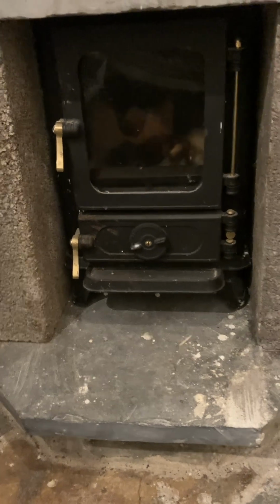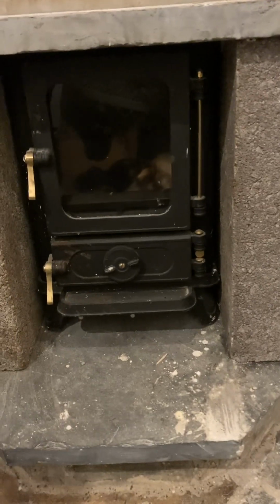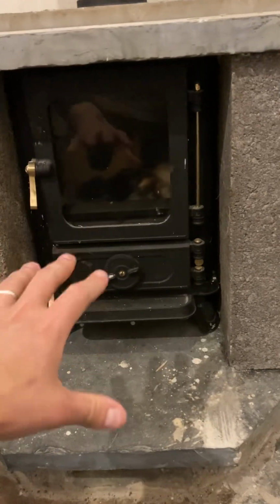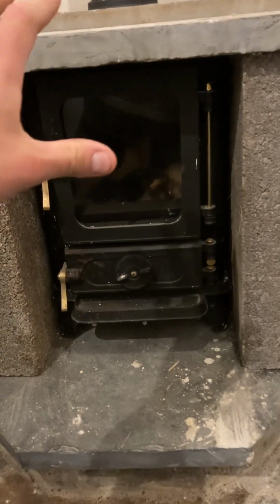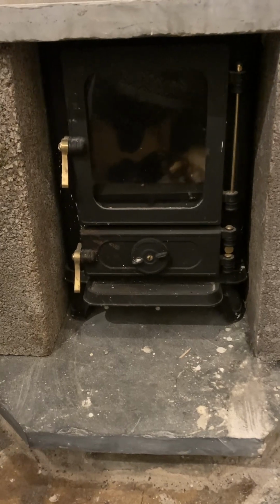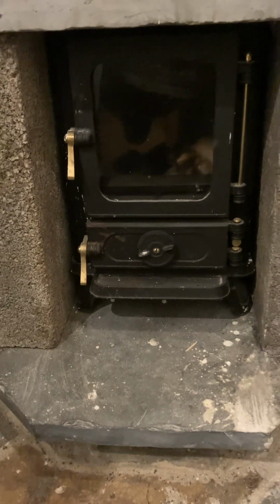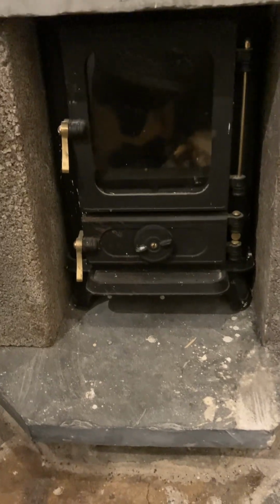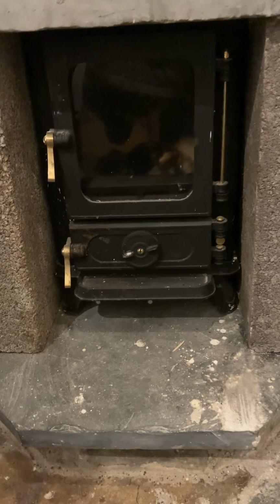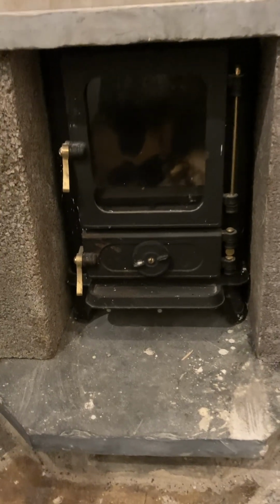And so the way you typically use a masonry stove is you load the entire stove box up, you open all your vents to the maximum, and you torch the fire as hot as it can go. You typically build a top-down fire, and you burn the wood from the top down, which improves the cleanliness of the burn and the efficiency of the burn. And you try to maximize the heat output and burn it as hot as it'll go, as opposed to when you don't have a masonry stove and all you've got is a standalone wood burner.